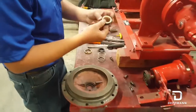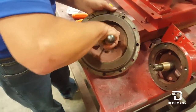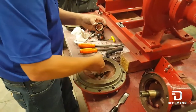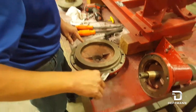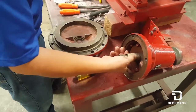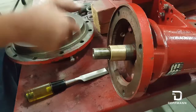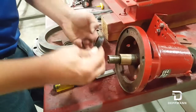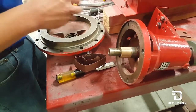This is our stationary part of the seal kit. Now that I've got the stationary part out, you want to clean this area up real good — this is an important part. What this actually does: this rubber boot makes a seal around here. So clean that up with a scraper; if you've got access to a sandblaster, that's great too. You also have a gasket around here, so you want to clean up this area to install your new gasket. Also, this brass shaft sleeve — it's got a bunch of grooves in it, so you want to replace it. It is a replaceable part. If not, you can clean it up with some emery cloth. That's an important area to get cleaned as well because this rubber boot is riding over this shaft, making another seal. So if that's damaged, you want to replace it; if not, you can typically clean it up and reuse it.